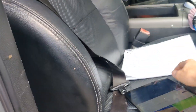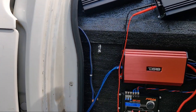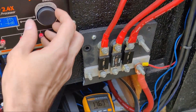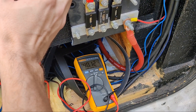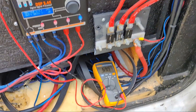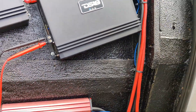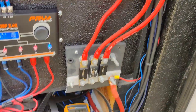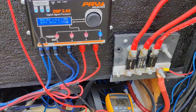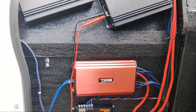You're going to want the 1,000 hertz test tone at about 75-80% of max volume. Right now we're seeing 11 VAC and we're going to go all the way up until we hit about 70. Keeping going up — right there we're at about 70, plus 6 on the DSP — and there's no clipping on the amplifier at all. That is cleanly at 70 VAC. No issues there. So that is option two — it's going to be very conservatively set, but that's how you know your amplifier has no clipping, no distortion, and it is set cleanly.